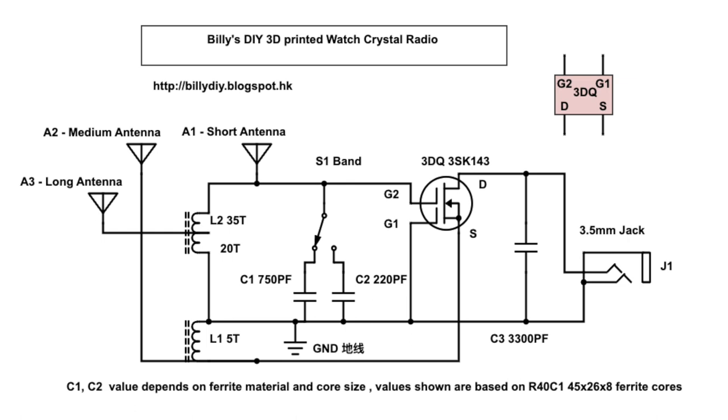The MOSFET circuit is similar to the diode, but the difference is you need a second coil to drive the MOSFET's source pole. Some people tap it at about 1/12th of the number of turns in the resonance coil and use that as the input for the source pole of the MOSFET. That works sometimes, but the better way is to create a separate second coil outside the resonance coil — it will sound a bit better. But if you don't want the trouble of making another coil, tapping from the resonance coil will also work.